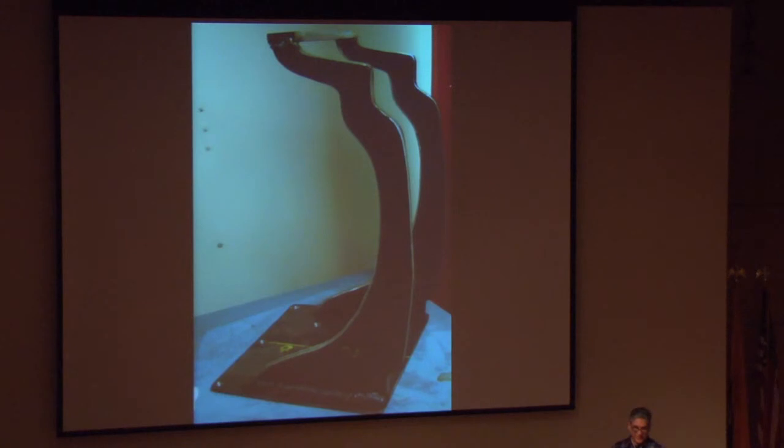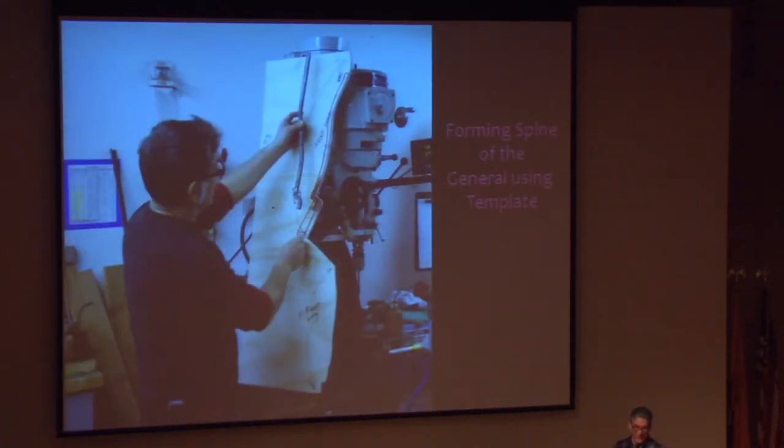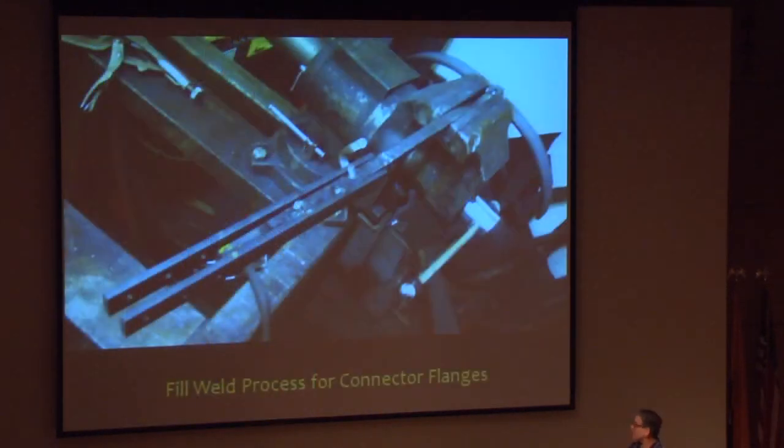There's the finished piece, almost welded up, and there's the top tang — I use a clamped angle to hold it in place while welding. This is the spine for the general, which has a sharp curve. I mostly cold-bent it with very shallow bends to give it some work hardening. For the sharpest bend, I did a heat bend — got that part red hot.